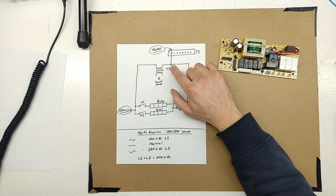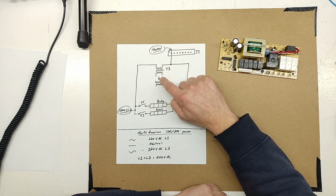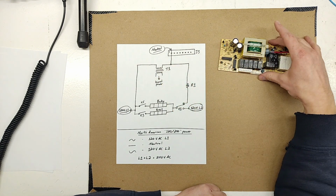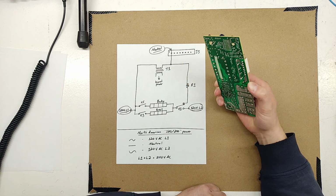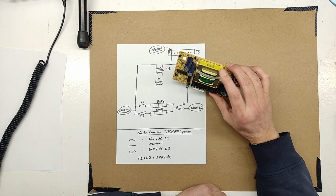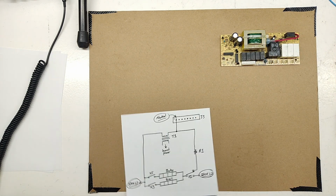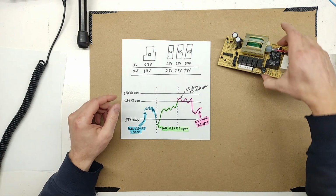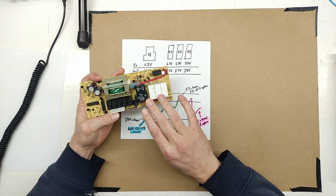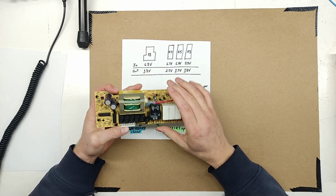What's happening when this neutral gets cut off here is your board power drops. So the voltage goes from 12 volts down to, who knows, 1 volt, 5 volts, lower than 12. When that happens, remember these relays, they're different sizes for one thing, and you'll never get relays that close and open at the exact same voltage.